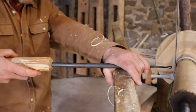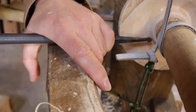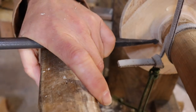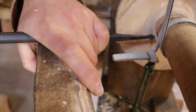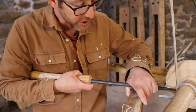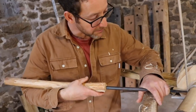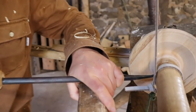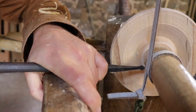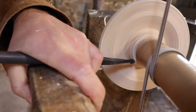And this is the beginning of undercutting the core, creating that shape. So offering up the edge of the tip down tool, twisting in slightly with my right hand to bring that top shoulder into contact with that flaring shape. I've got the hook tool in the crook in my arm, and I'm just going to start cutting here, and then following that flare down. You should be able to catch it on the camera.